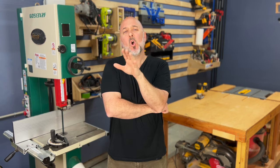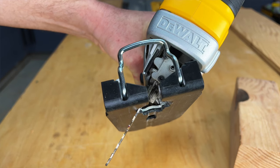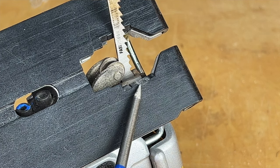Con number two: when doing 45-degree cuts, the blade cuts into the shoe cover. Not by much, but it does mar it. The shoe cover is there to provide a smooth surface to protect your work surface. This seems like a design flaw that can easily be fixed.